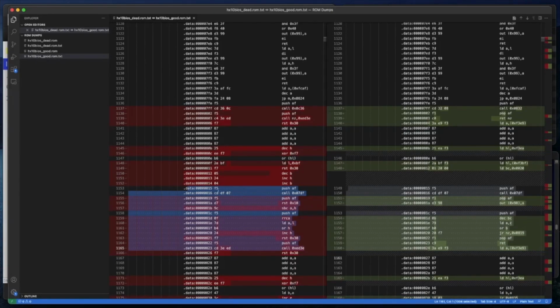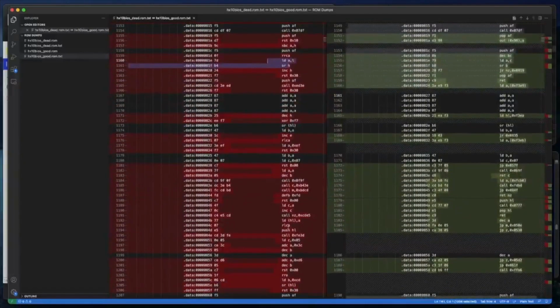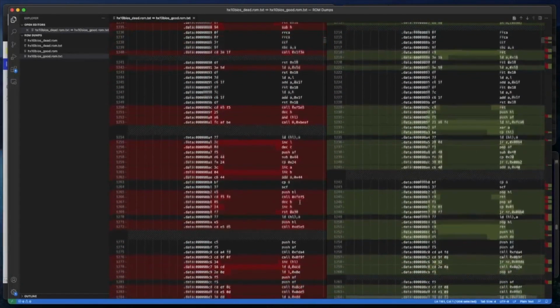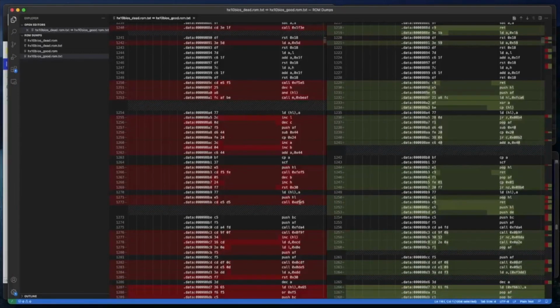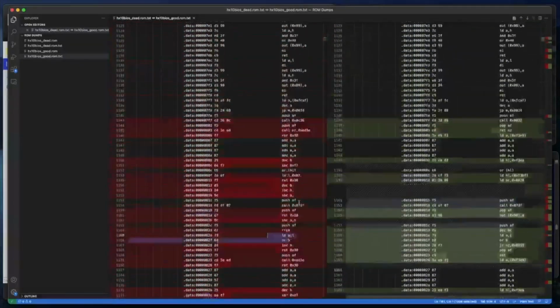This on the left, it looks plausible at a glance, but actually, if you follow the logic through, it's gibberish. It's not balancing the stack. Looks like it's checking whether HL is 0, but then you're increasing H anyway, so you're destroying the flags that have been set up here. Yeah, this looks like gibberish. I can see why the ROM on the left's failing anyway. And there's more examples of this as you go through. I think I've seen enough just looking at that little bit of code there, to be honest, to realise why this code wouldn't work. So in summary, the corrupt ROM's just running random instructions in places.